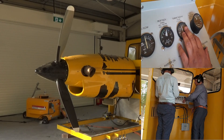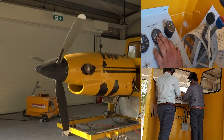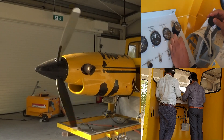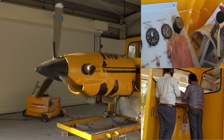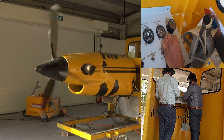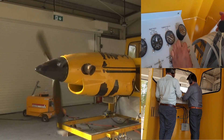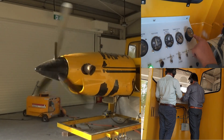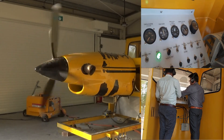We have to turn on the booster pump. I will take the fuel valve and introduce a little fuel into the turbine part. I will turn on the booster pump. At 18% N1, I will introduce the fuel here — I am applying the fuel inside. We have to wait — this reads 680 — so you have to wait around one minute to get the light-off.